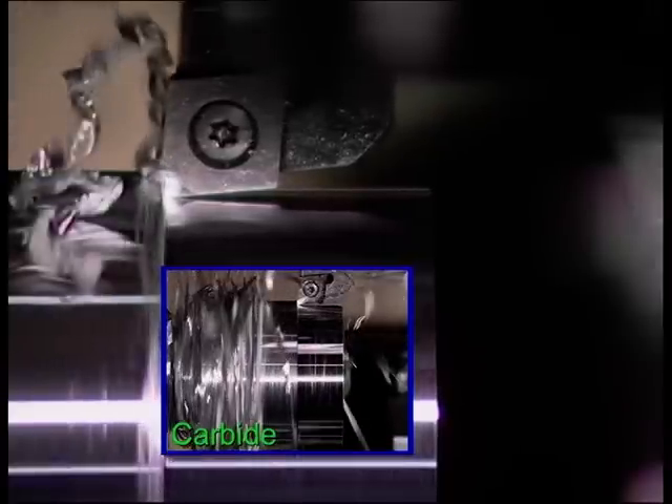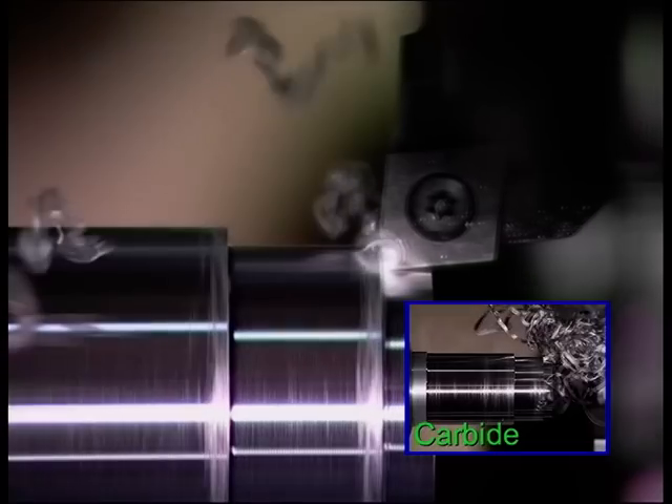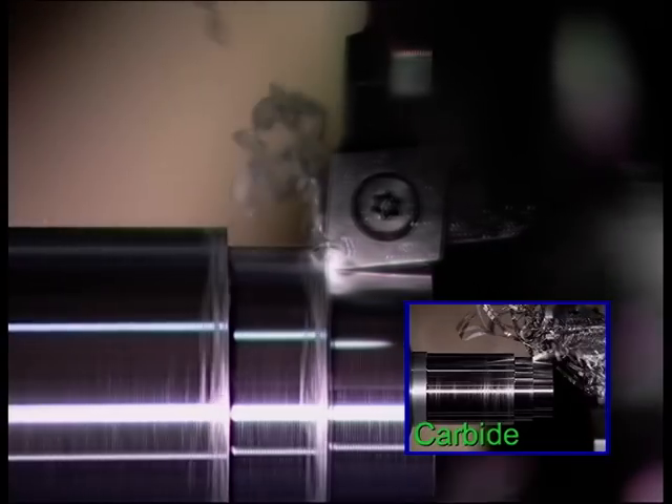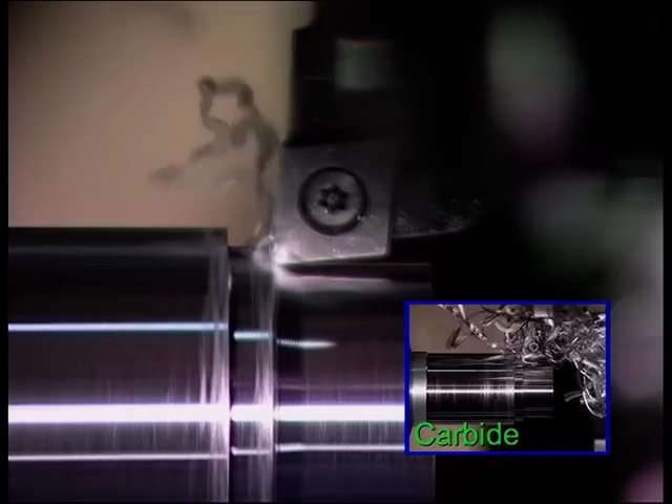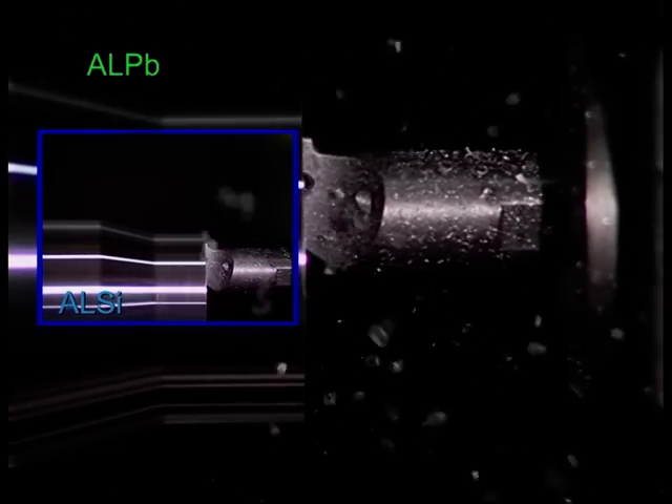This way, short chips are produced with Becker PCD and diamond inserts — trouble-free during the process, competitive, and eco-friendly regarding waste disposal, as the chips assist in setting the lead-based additive in the aluminium aside. The Becker chip breaker: a forward-looking development.